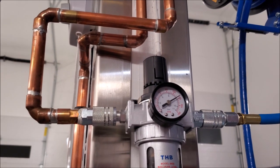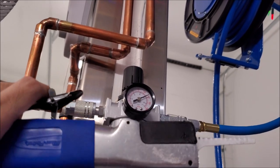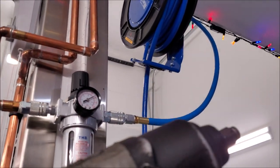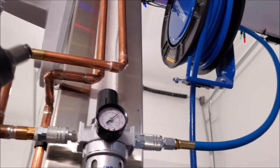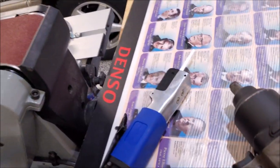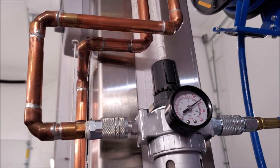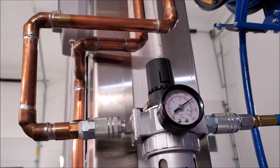To demonstrate — you can see we're just below 120 PSI on this airline. If I run my reciprocating saw, watch the gauge: it stays a bit above the optimum level. Now with the impact wrench, which needs a little more juice — you can see it sucks it down to 90 PSI. That's where I found the middle ground: it goes almost 10% higher for the reciprocating saw, but for the impact I needed it that high because dropping another 10 PSI left me without enough power for it to work properly.